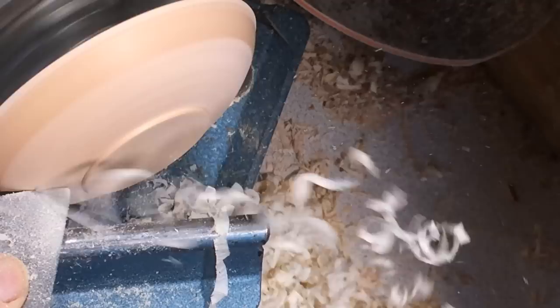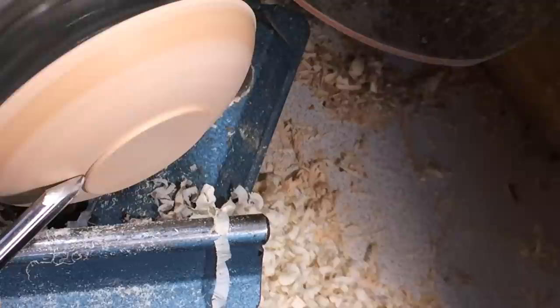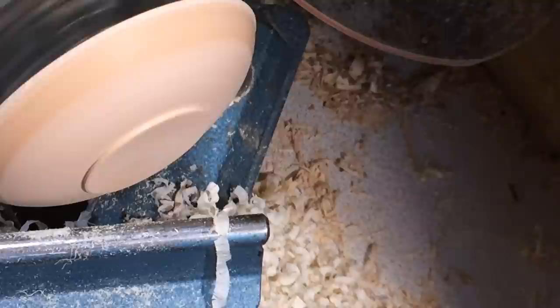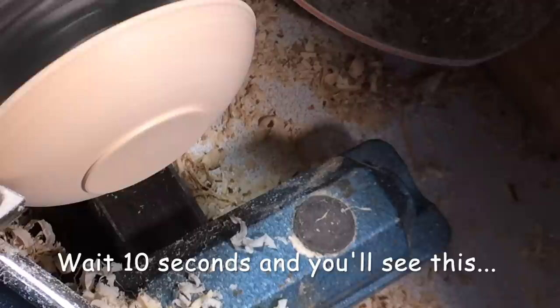Now the wood, as we've already ascertained, is a bit thin, so I'm not going to have a particularly big foot. 3/8 spindle gouge again, right on its side - just ease it in on top of the foot and rotate it very slightly anti-clockwise. You can see where the dust is coming off there, and then I can turn the tool over and use the other wing to do the other side. So that's rounded - abrasive will do it anyway. Coming round the edge here there's still the hint of that little rim, and I'm going to shear scrape that, tilting this tool up on its side.